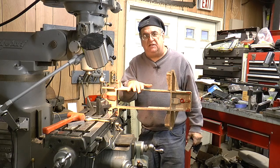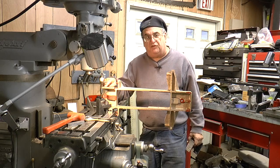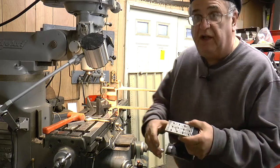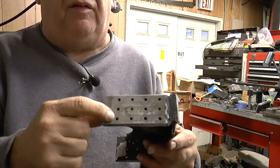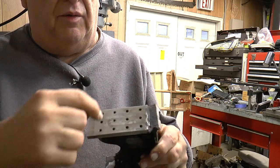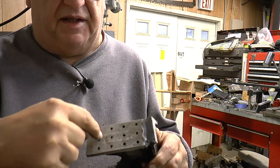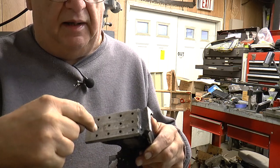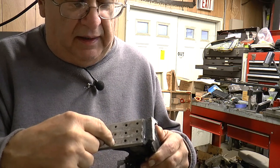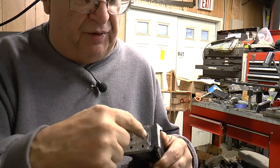What I've done is put this in place, got it all lined up in the locomotive, and I transfer punched six of the holes - the only six I can get at. Those are the first six here. Now I'm going to do the others. I'll pick up these and they're exactly three-quarters apart, at five-eighths I think this way. They're pretty good because I did them, so I know they're right. I dialed them in - I didn't have a readout then.